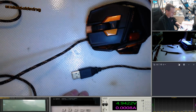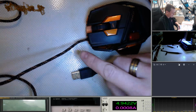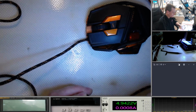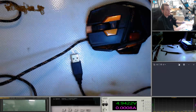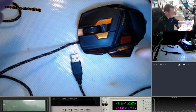So it's a good guess, and you have to kind of guess in this game. You can't be spending ages going along, testing it, wiggling it back and forwards, because really the only way to test this properly is to continuity test it, which is to put your probes in there, take the probes onto the other one, find out which one of these leads is broke, and then go along taping it down bit by bit. You just need to take a guess. This here is a high traffic area, so we're going to start there. If it works, it works.